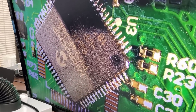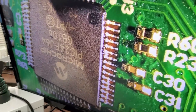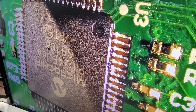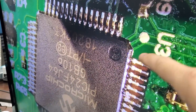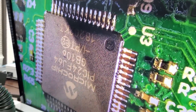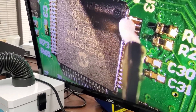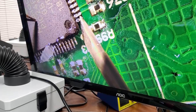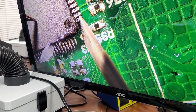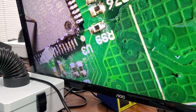Here we are working on another chip. I told Angel you can secure one or two of the pins — solder a pin right here, then apply hot air so the chip is secured on the board before reflowing. If you don't do that the chip is going to shift. Apply the tip from the side of the pin so you have more surface area.